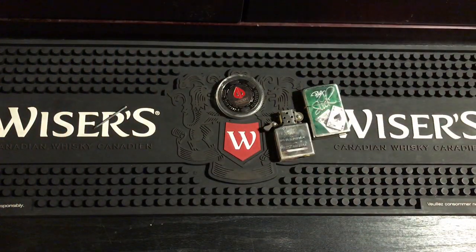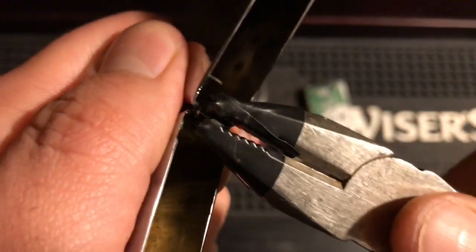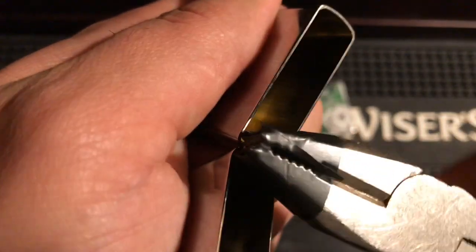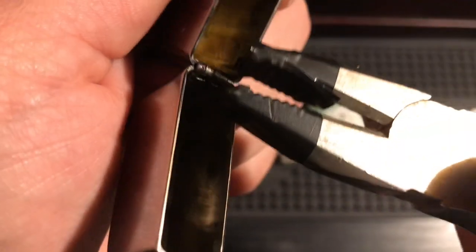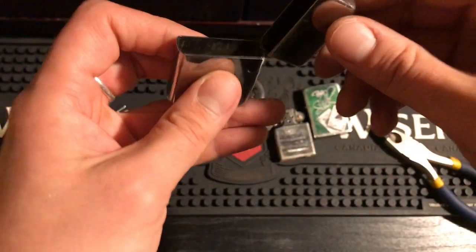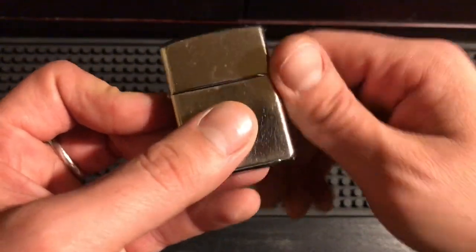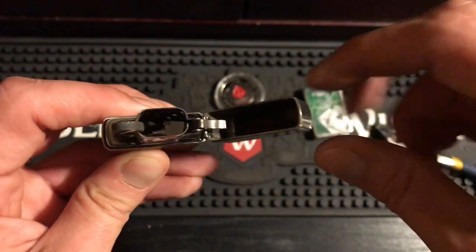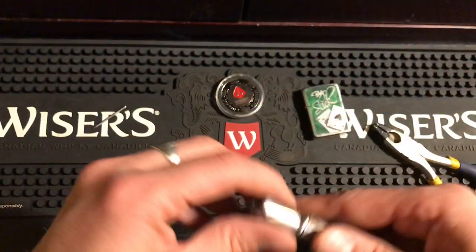Watch your tape — sometimes it'll help it slide off. So the first one, the corner piece, tighten — done. Second one — done. Middle one — done. Now flip your Zippo and get the second-to-last one, then the very last one — give that a good tighten too, because that's what's going to seal that pin back in there. Let's see — that's very tight. Insert back in. A little bit of an overbite I could fix, but this hinge — look how tight it is. I'm holding the Zippo as tight as I can and it doesn't even move.